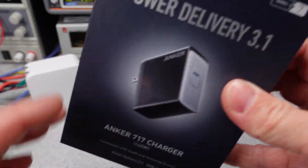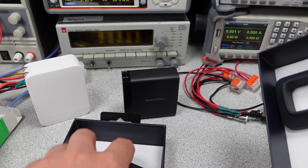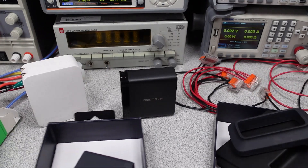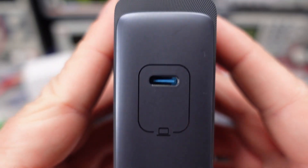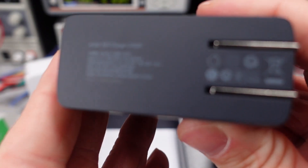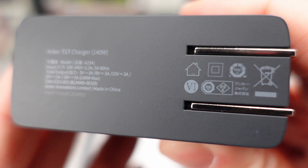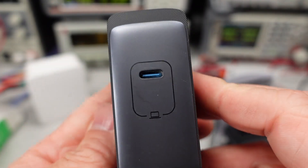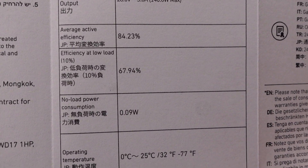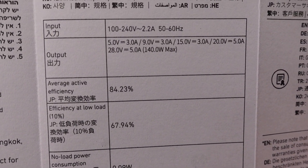The Anker's new boxes spell premium. I pre-applied a sticker to the outside of these boxes to make them easier to open. We get a plastic tray so we can find the donut — an accessory intended to help the power adapter stay in the wall socket better — and they give a little instruction card for this as well. It has one USB-C port, 140-watt capable, but just one port. The adapter has a safety listing and the DOE 6 mark. With only one port, it's basically begging people to buy the 150-watt GAN Prime adapter instead — though that adapter can't do 140 watts on one port. They could totally do that and have the ultimate power adapter; I guess they need to save something for next year. The Anker user manual makes some decent claims: lower idle power — which we can check — and decent overall efficiency. There is only one port, so no port sharing diagram required.